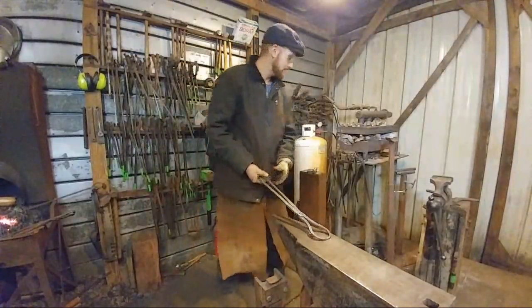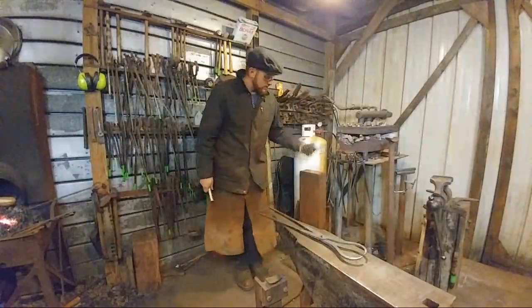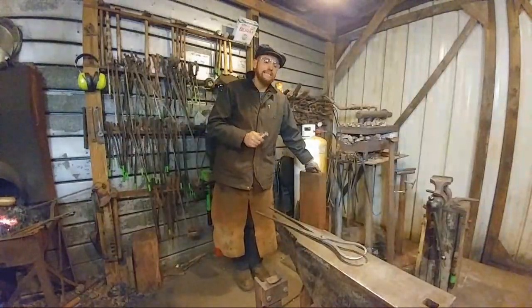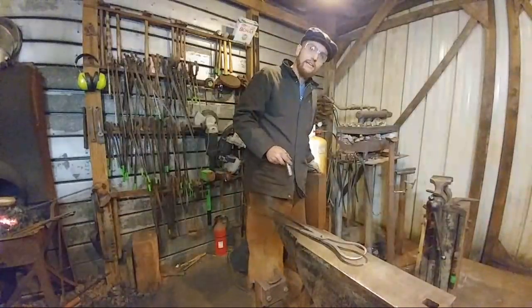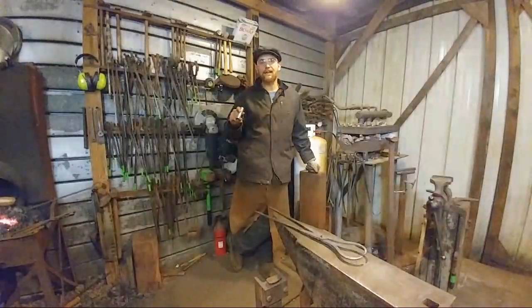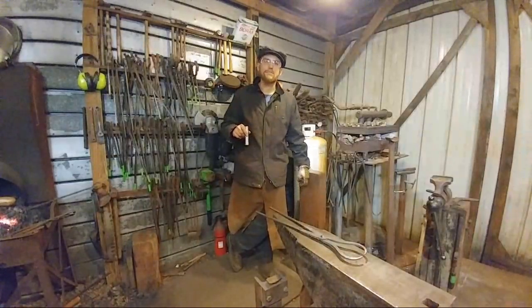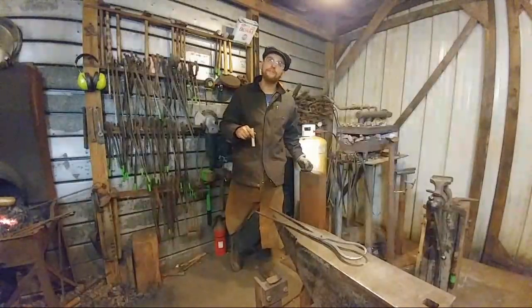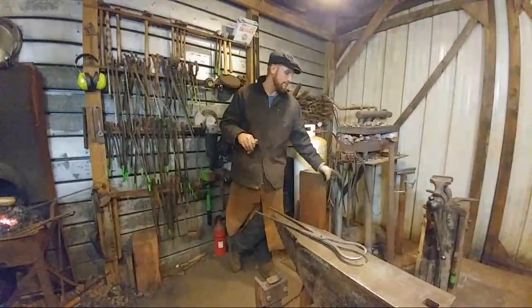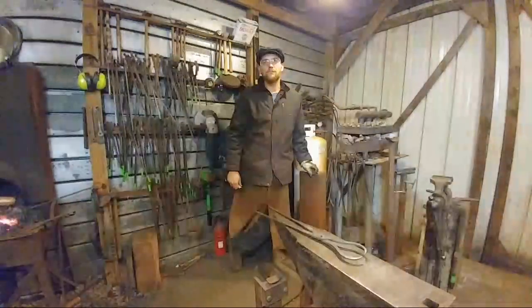Oh, somebody was asking about your big block right there. That big steel block. Oh, this big steel block. Okay, well, some people start commenting on that. I'll talk about it. So, I was going to be contracted out to do silver work for a living, and I kind of got it in my head I needed it. At the time, I didn't have a very nice, clean anvil face, and for silver work, you want a really nice, polished anvil face if you can, with a really nice, polished hammer, and you want to keep them that way. And so this started off really polished, but this is a 300-pound block of steel standing straight up, and then it's hard surfaced to be like an anvil. And then I cut in dovetails, just kind of fabricated dovetails, to eventually drop in different types of horns and stuff for doing vessels and different things. So hopefully that answers that question there.